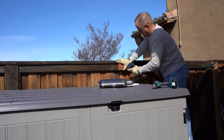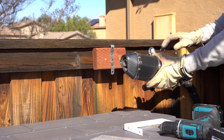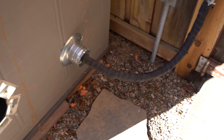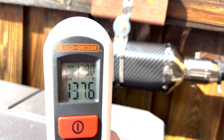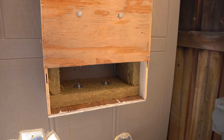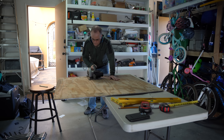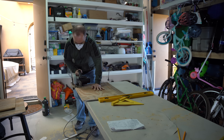Next I put a small block up on my fence and hung a motorcycle muffler up here. I specifically chose this muffler after looking online - the engine type and everything lined up well enough that we didn't get a lot of pushback on the engine from the exhaust. This was designed for about a 400cc motorcycle and it was able to help drop the noise significantly. When I ran this it got up to about 140 degrees give or take. Now one other issue is on our air intake and exhaust - noise is going to escape - so what I did is I built boxes. I did a lot of measurements first and wrote down all of the measurements in advance and used that information to cut out pieces from old plywood to make these boxes.